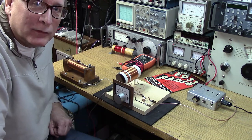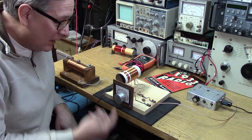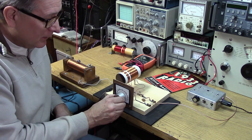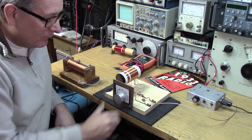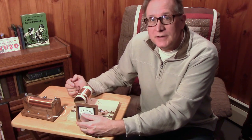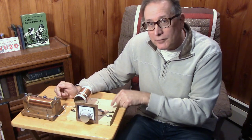So I'm not going to go any further than this. We've gone over the basics and hit the radio construction details — antenna and ground. You've been able to hear how the basic crystal radio setup with the tuning coil can do about as many stations as an AM table radio. That's pretty good for a crystal radio, and it has adequate selectivity. We get the selectivity both from the low diode tap and the loose coupling on the input link on the primary.